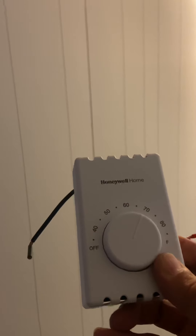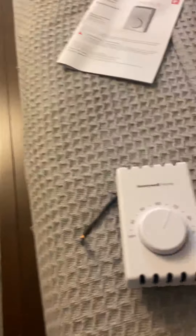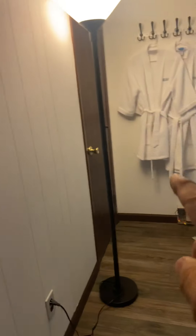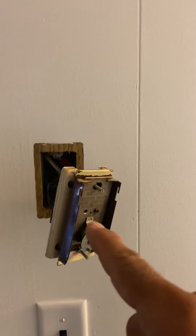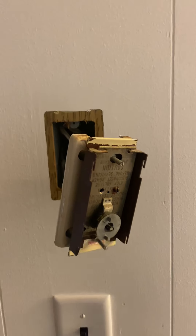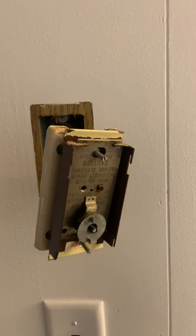Otherwise you can just look at the label to see which is which. One other thing regarding these thermostats: if you use all four wires and it says 'off,' it actually shuts off because it cuts both lines. But if you have a single pole connection like this one, even though you put it on 'off,' it's not really entirely off — you've got one line going straight to the radiator. So you've got two lines waiting: one from the panel at 120 volts and one from the radiator at 120 volts. A lot of these single-pole types will trigger on once it reaches a certain temperature, like 40 degrees.